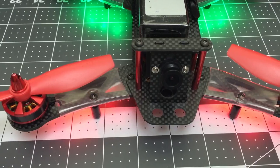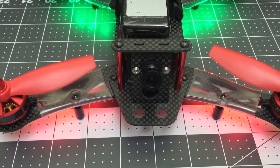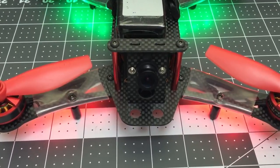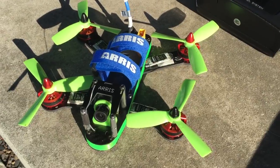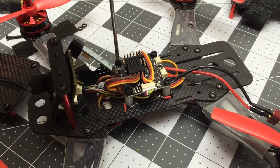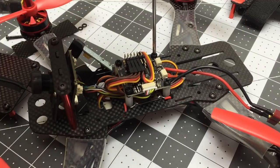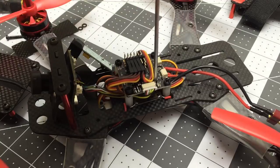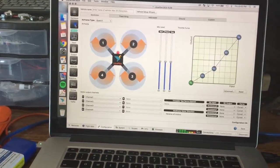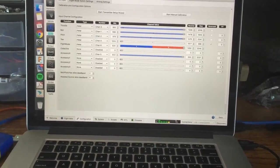So here's what I actually think of this thing. This is not a maximum performance race quad, and it's not going to win any real races — there's not really anything special about it. But I kind of like that. There's a huge upfront cost and learning curve to building one of these yourself, and this quad is an affordable way to get started while still providing the opportunity to learn more. Some RTF quads are so compact and integrated it's hard to work on them, but this one's pretty good. You could put all these parts on a different frame, put different parts on this frame, try a different flight controller, or even make an airplane with them. The flight controller is a CC3D, and you can connect it to LibrePilot on your computer to change settings like roll rates and flight modes. I brought the roll rates up from around 360 to 720 degrees per second and now it's very snappy.